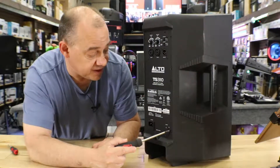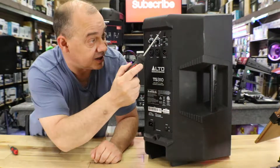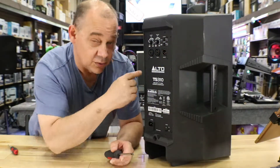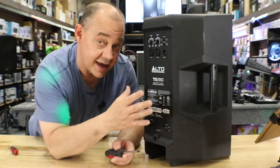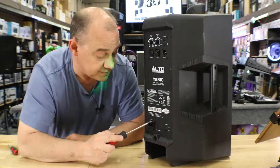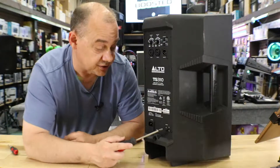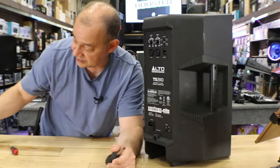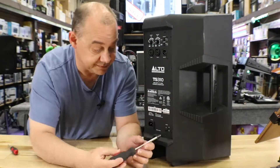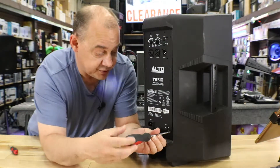To do that, we're going to find that there are 12 screws located on the back of the speaker, all along the outer ridge. We're going to remove those screws so we can carefully remove the amp plate and get access to the bottom. The actual jumper is located just above the power cord, right inside the unit. Take note to not lose your screws — you will need them for reinstallation. All 12 screws are exactly the same, so once you remove them, put them in a safe place.